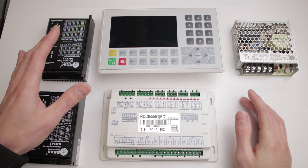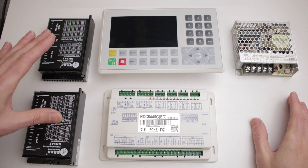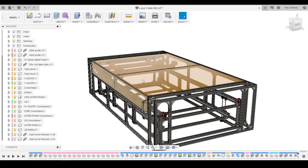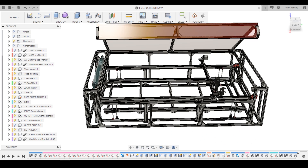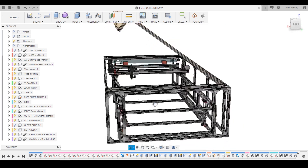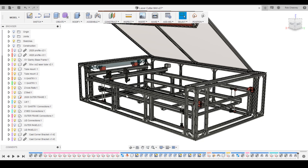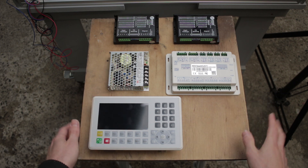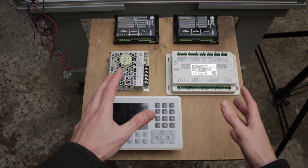So these are the parts we'll be hooking up today: a 24-volt power supply, two stepper driver controllers which connect to the stepper motors, the brains of the whole operation — the control board — and the screen and interface unit. One of the major design considerations from episode one was being super efficient on space, maximising the cutting area for the size of the machine. One of the places I'm going to save space is by placing the electronics in a separate enclosure below the machine. I'm going to connect up what we have here temporarily on a bit of plywood, and once we've got the layout sorted I'll get a nice enclosure set up later.